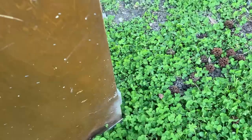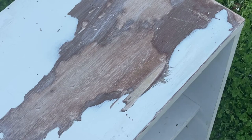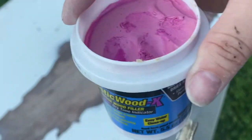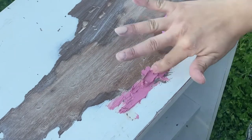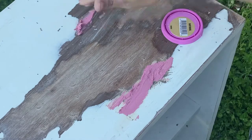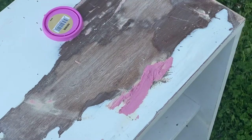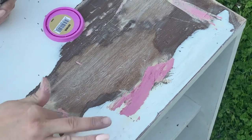I fixed a few nails that were popping out in the back end, which tightened everything up nicely. For that lovely gash, I used wood filler — one of my go-to fillers because it dries so fast and is really easy to use. I just plopped it in without worrying about thickness, knowing I'd sand it down. We had a day around 60 degrees outside, which was perfect for drying.